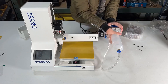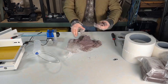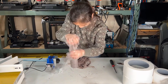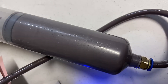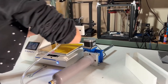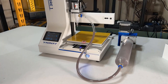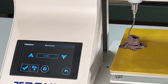Let's turn off the printer and remove the barrel. I will use some of the packs of clay that came with this printer. They seem pretty wet and ready to use. I will mix and squeeze them a little bit and put it inside the barrel. In order to remove the gap from the clay and move it all the way to the bottom, I will throw the barrel on some magazines I put on the ground and repeat this process. Then I will put everything back and screw the barrel back onto the gearbox — make sure to do it slowly and not to damage the threads. Connect the tube to the coupler on the barrel and the printhead. Now we can move the piston forward to push the clay all the way through the tube. I used the maximum speed of 40 to move the piston from the top. When the tube was filled up with clay, I slowed it down to around 5. Once I saw some clay coming out of the printhead, I slowed it down to 0.7 and let it extrude for a while until the clay is smooth and consistent.